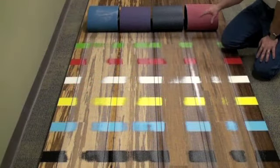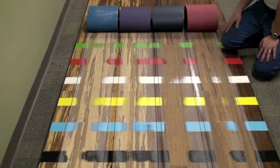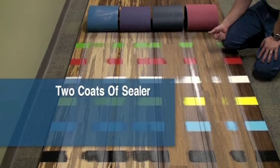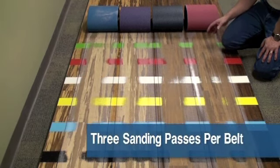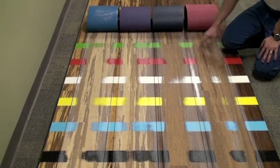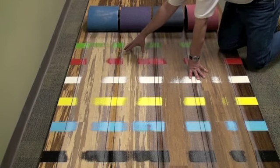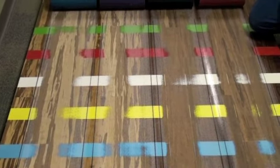What we see from this first pass is brand new 50-grit belts from two different competitors and the regular Bona Blue product. We were gauging how they perform brand new out of the box. On this panel we have two coats of sealer, then the paint lines, and then four coats of finish over the top. It took three passes with each belt to really start cutting down through the paint. The cleanest section came from the Red Heat, with Bona Blue not far behind. The Regalite and Norzon Plus were pretty equal to each other, but both fell short of the Bona Blue and Red Heat.